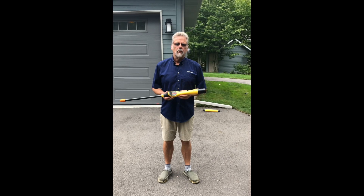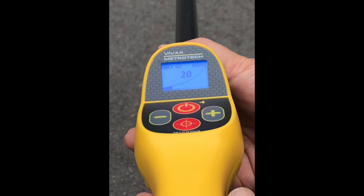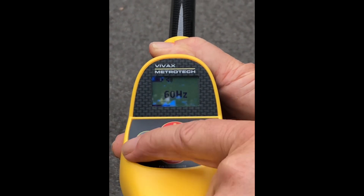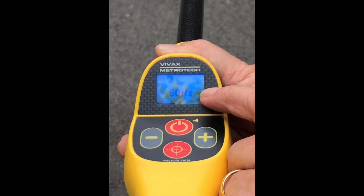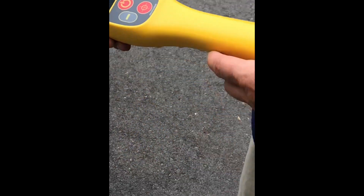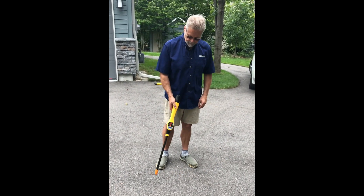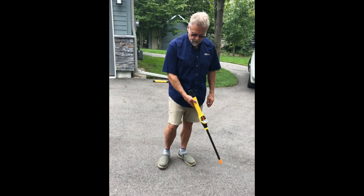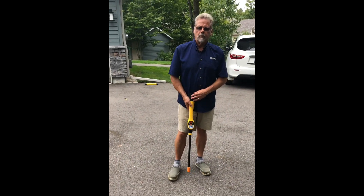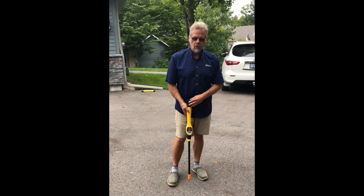Another great feature of the VM-550 system is power mode. You can locate using the receiver alone in power mode 60 Hertz even without using a transmitter. To activate 60 Hertz on your receiver, push and hold this button until the last frequency you used pops up, then scroll up and down with the plus/minus button until you see 60 Hertz, and push the button to turn it on. Take the receiver down to where you think the line is and what you hear is that power sound when you're on top of the conductor. Adjust gain and zero in on exactly where that line is. 60 Hertz finds the most dangerous conductors — the ones that are loaded with a good 60 Hertz field.